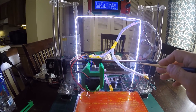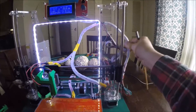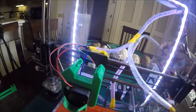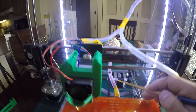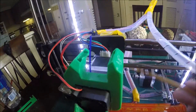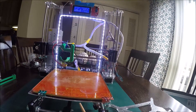When you look at this online on the Amazon or RepRap Guru website, you see all this wire loom on it — it didn't have that, I added all of it because the wires were just a mess. One of the big issues I was having was the printer bed wires getting caught in the back on the stepper motors and the bars. The wire loom has definitely helped — the wires haven't broken off yet. I'm thinking about some way to suspend the wires to reduce the chance of those print bed wires breaking off.